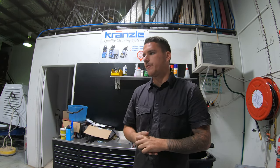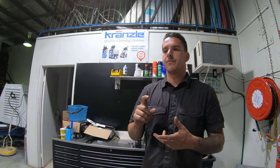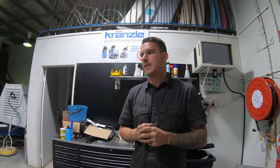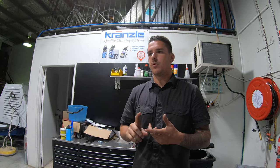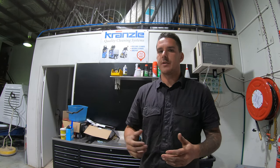It's gonna be a long process so I'm gonna try and film the whole lot. So far all I've done is clean the tray - I've used a chemical on it, a professional alloy cleaner. You just spray it on, let it sit for five minutes and rinse it off. Then I've used scotch bright or steel wire, rubbed that back with inox, and it's come up pretty good - really shiny, surprisingly.